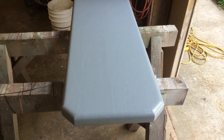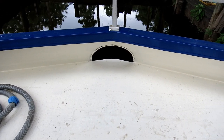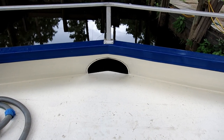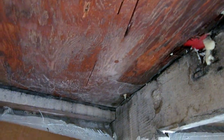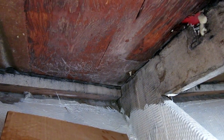I put a layer of epoxy paint, sanded it, and that's good enough until we get to the boat. This is the front of the boat where the anchor pulpit will be — it's going to stick into the boat 18 inches and there's not much there to bolt it to. I'm going to get underneath, make some templates, and double up the plywood to try to make this a little stronger up front. Laying down in the anchor locker, this ceiling where the anchor pulpit will be bolted through is basically flat plywood. I'll cut a cardboard template, cut a piece of plywood, and double it up — I think it's three-quarter inch with fiberglass on top. If I double it up, screw and glue it well, I'll have an inch-and-a-half deck.